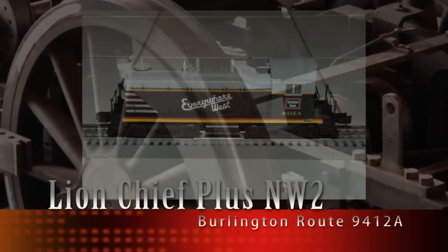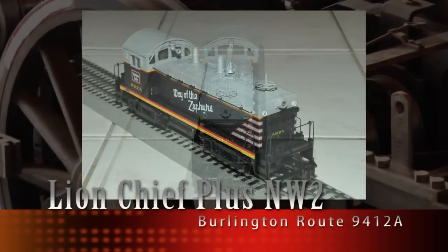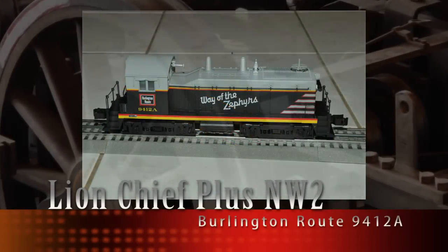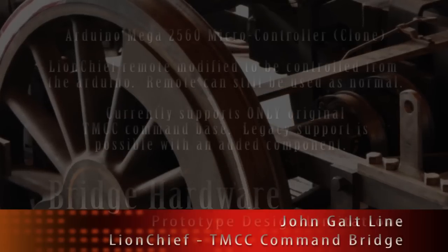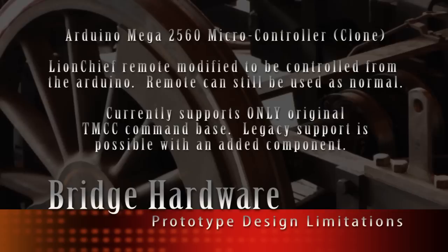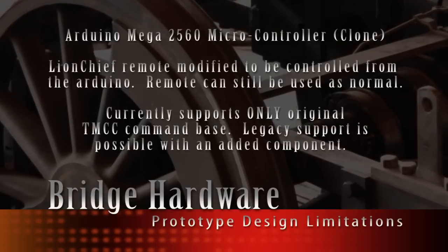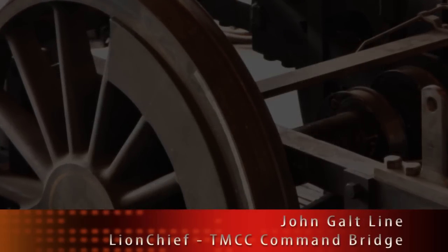For this demonstration, I'll be using my LionChief Plus NW2 cab number 9412A. The bridge uses an Arduino microcontroller to take TMCC commands and relay them to the LionChief Plus engine. In the future, I hope to use one of the universal remotes in place of the original.